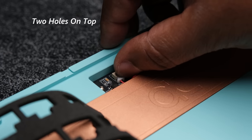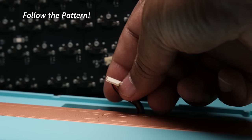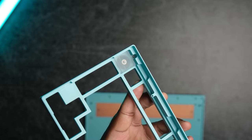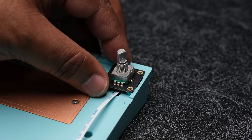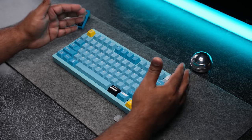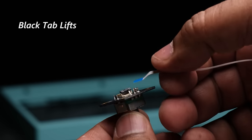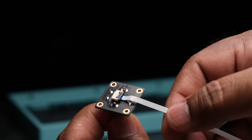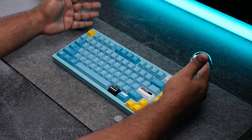Next, install the battery cables to the daughter board, then take the one wider JST cable and install it to the PCB. There's a right and wrong way to install it, so follow the pattern of the connectors. If you're going with the rotary knob, you will need to remove the badge holder that comes pre-installed in the board by removing those screws. Then take the rotary encoder and install it to the bottom case with the screws provided in the kit. I recommend installing the ribbon cable first before screwing it down. Installing the ribbon cable can be a bit tricky — make sure to lift the black tab up and push the cable in as far as possible with the blue side facing up. Once it's all the way in and straight, lower the tab down to secure the ribbon cable. Do the same to connect it to the PCB. I find it easiest to rest the PCB behind the bottom case to get these cables in a little easier.